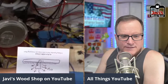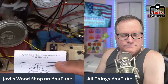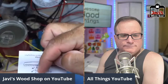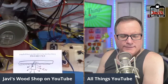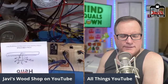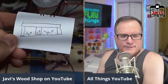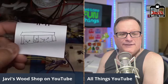If you put a thermal barrier, a radiant barrier, up against the plywood roof on the inside, this is the attic down here. What will happen is through conduction, it will transfer the heat to that truss. The truss is naked and then it's radiating heat. Yeah, you could wrap it, but that's a heck of a lot of wrap. The other option is this: you take the thermal barrier and you staple it, truss to truss. Obviously, you see what I'm saying?